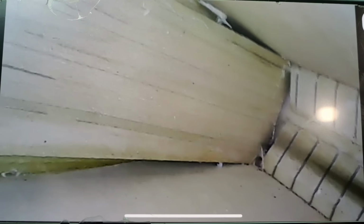So what we can see inside here is how they use the curved edge, usually made out of some sort of mahogany, that just kind of braces the top and sides together. And you can see that large block they use. And this is the bass side cutaway that we're looking at right now. But that continues down the entire center of the guitar until we get to where the strap button is inserted in the bottom. And remember when we were talking about the spruce bracing? That's what we're talking about right here.